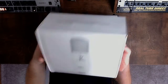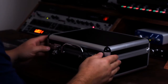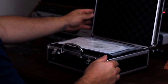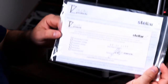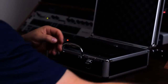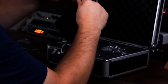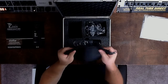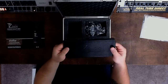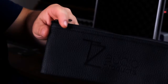Their website states that they have a custom-made low-noise transformerless JFET circuit that uses high-quality components such as German capacitors and high-tolerance parts. Their K67-style capsule is made from Japanese-imported mylar and is gold-sputtered with a proprietary technology. The combination of these features yields a microphone with a high-output signal, extremely low distortion, low self-noise, and a very balanced sound. Some of the exemplary features that I'd like to point out is that the Stellar X2 is designed to actually be flat and neutral, with a slight boost in the presence region for added clarity and depth. In my personal opinion, this makes the X2 easily set in any mix without much EQ or post-processing.